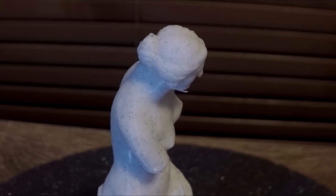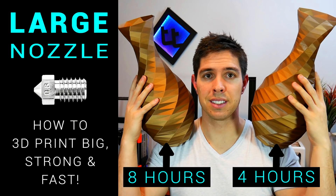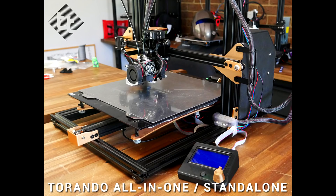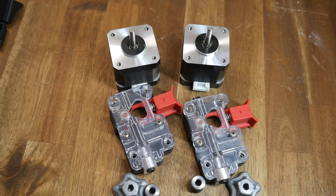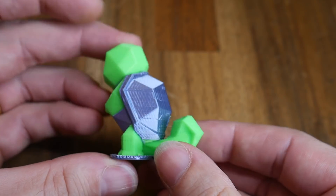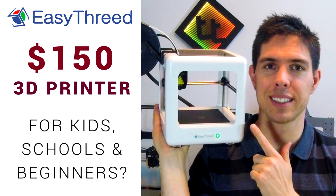Apart from having to ground the mains-powered AC bed, the Tornado has been flawless. It's been an absolute workhorse and I've put many hours onto it over the years. It's been great for testing large nozzles, removable flexible build surfaces, and the direct drive E3D Titan Aero. Recently I converted it to be an all-in-one machine and upgraded it to dual extrusion with a switching nozzle kit. The A10M donated its EZR Struders and twin filament mounts. There were some teething issues during this upgrade, but it's really breathed new life into the printer, and I look forward to experimenting with multi-materials in the future.